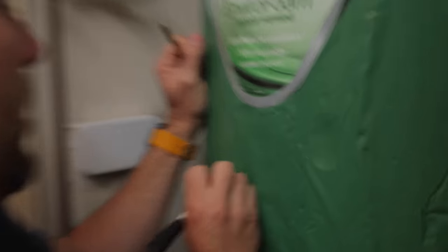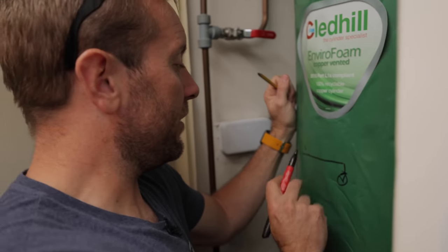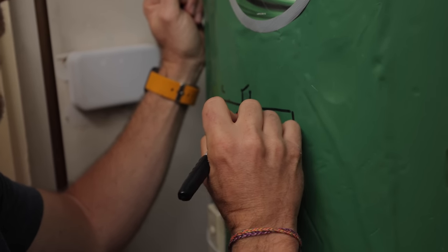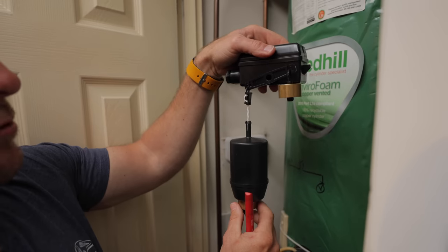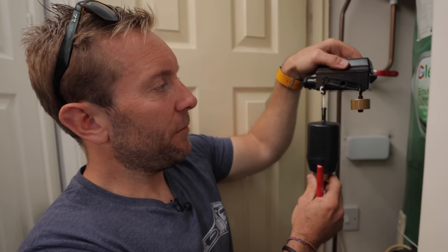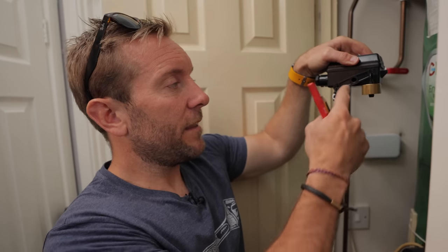Let me draw what's going on. We've got our live in, and normally you just run your live over to your pump. But what we're going to do is run up to a little switch that is effectively going to be moved up and down by the float. When the water level is high the switch allows electricity to go in and out off to our pump. But as we use more water and the level drops, the float goes down and cuts off the electric supply to the pump. Head over to Artisan Electrics and hit subscribe there as well.